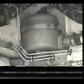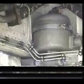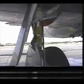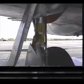I'm under the right wheel well, panning into the wheel well. That happens to be your low-pressure fuel pot — it's your filter. It's changed whenever there's a problem with a bypass light, whenever you think you have contaminated fuel, or once a year. I keep the struts fairly high because they're light on fuel; I cuff them for long-term storage so the strut can't drop on a Bonanza wing or whatever. Tires are 14-ply and new. Brakes should be checked for wear and tear on the inside — these brakes are brand new. 14-ply brand new Goodyear tires.